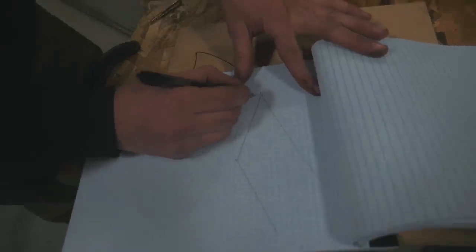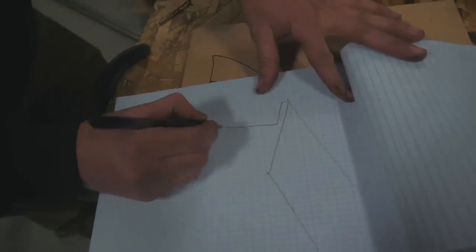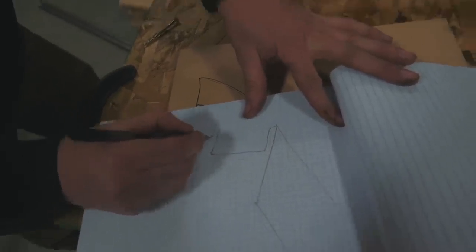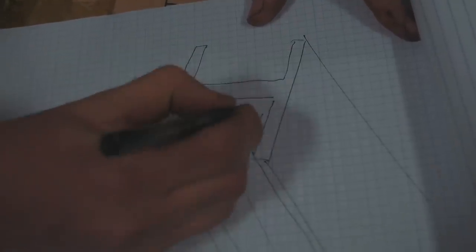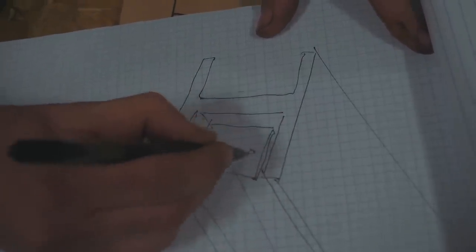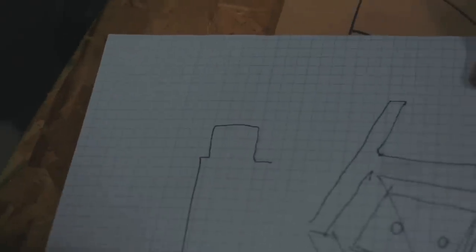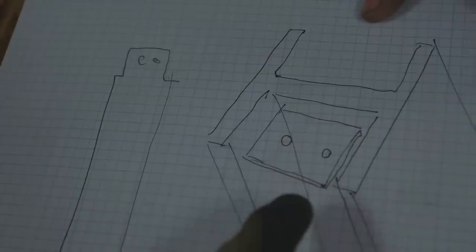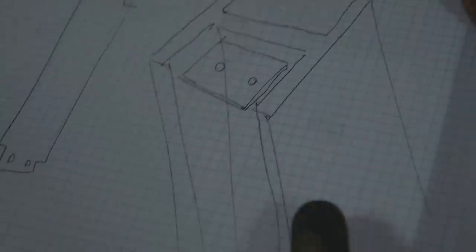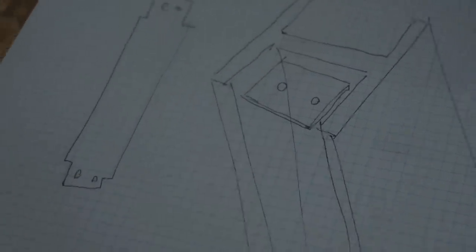So the way that we're constructing this, we are gonna have one W beam coming across like this, and we're gonna do what's called a knife plate. A tab of steel that gets welded onto one beam like that. It's gonna have two holes in it. Then a female W beam is made where we cut off the top flange of the beam there. It has holes in it. It bolts onto here so that you can have one beam going this way and one beam coming that way. This is very much like a common connection in industry and how they put up buildings, right? This is exactly the way we do it every day. It's a very mechanical looking connection, which I think is what you're after.